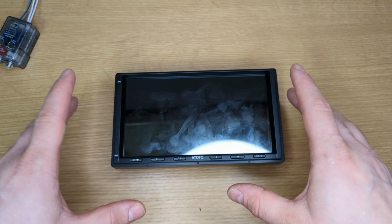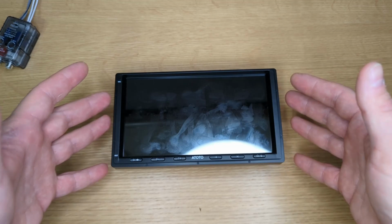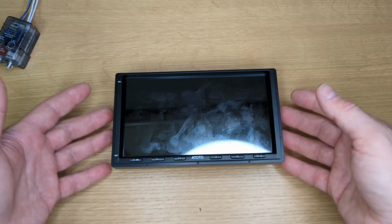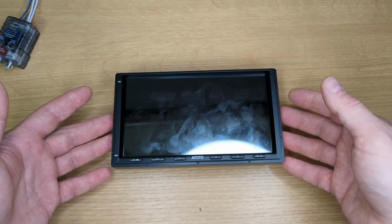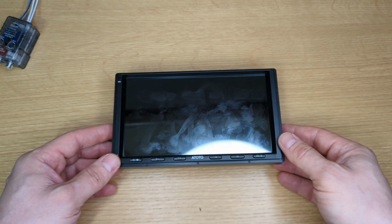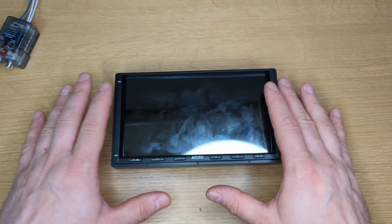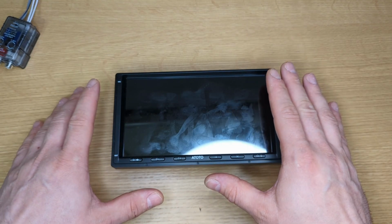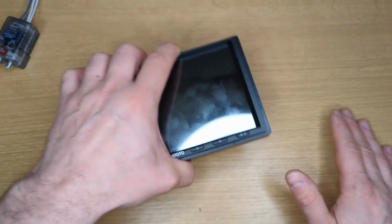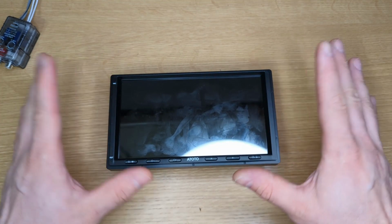However, this is the level of distortion that you have from budget and SPL type amplifiers such as Taramps, D4S, JP amplifiers, maybe SCAR, and Zapco. Now, yes, you might think, really? Zapco? Yes, from what I saw, Zapco amplifiers objectively, measurement-wise, have the same level of distortion as this Android head unit. Granted, they have much more power, but cleanliness-wise, it's kind of the same.